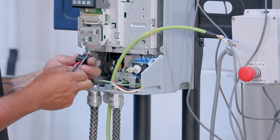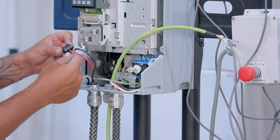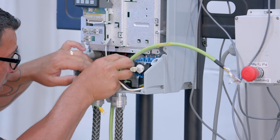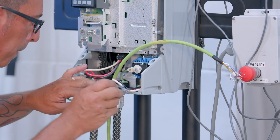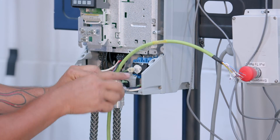You can bring all the wires for the three leak detectors, the e-stop, and the PTO sensors into a junction box located at the pump, then exit the junction box with one multi-conductor cable back to the VFD through one cable gland. This is how the three leak detectors, PTO thermal sensors, and e-stop were wired as shown in this video.